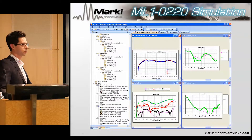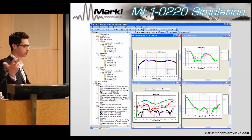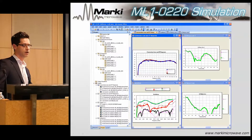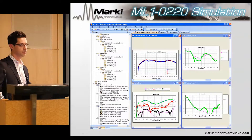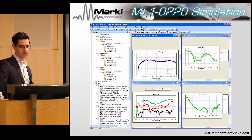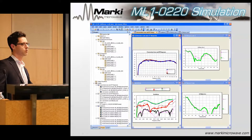The linear specs are great — isolation, conversion loss, return loss. I should point out that the isolation doesn't match perfectly, especially as you get to lower and lower isolation values. Once you get below 30 to 40 dB, the numerical inaccuracies start to become a little problematic. If fabrication is off by a few percent — maybe 10 percent on a line width — it could change the impedance to ground and change the overall balance of the balun. Once it's accurate to about 30 dB, if it's not exactly right at 40 dB, there's really nothing I can do — and that's basically in the noise of the fabrication anyway.